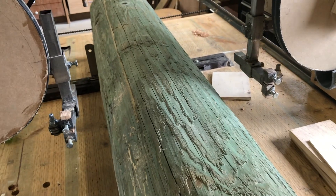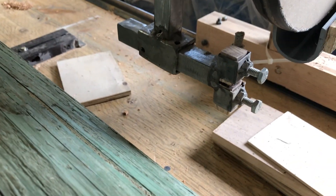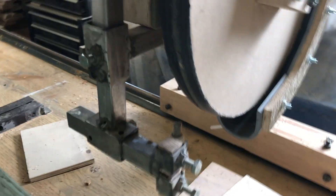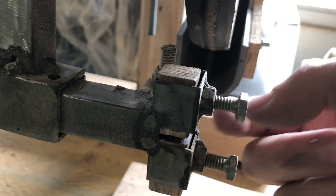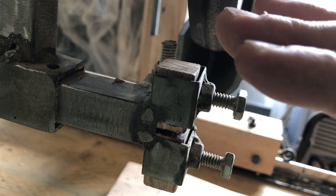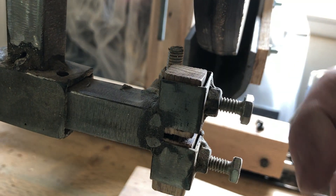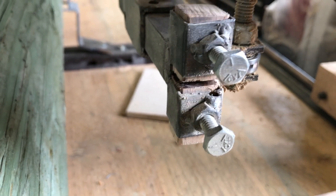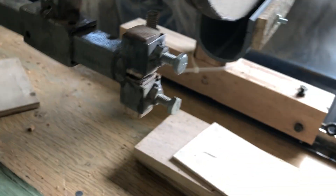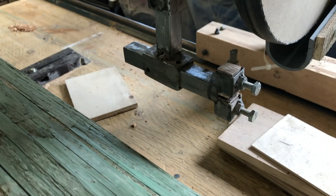So I'm thinking it's probably time to have another look at my blade guides. A couple things that I want to address here. One is I believe that these guides, these little blocks, are not coming far enough forward on the blade, and that accounts for some of the blade drift that I've been getting. These only come about halfway across the width of the blade — I think they should come just a little bit farther. And I want to do something about these bearings to make them work a little bit better. So fundamentally I'm going to be looking at this assembly, this piece here. That is today's adventure.